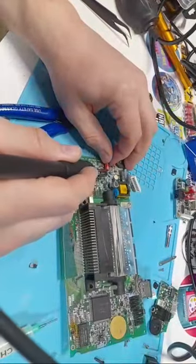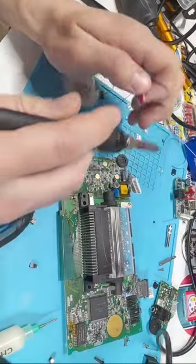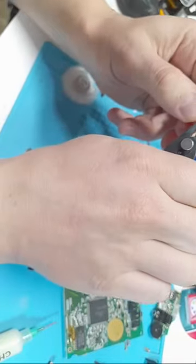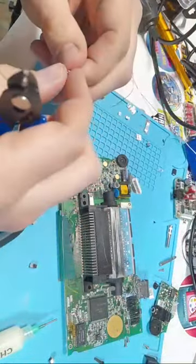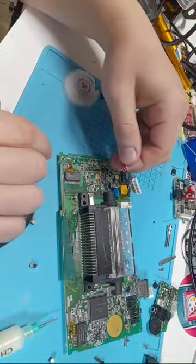That's one way, and then the other way is what I call the toboggan method. Again, coming out with more names. So the toboggan method, which I really use a lot on the audio board because it's very limited for space. So I'm just basically going to push these down. It's better when they're longer, but they're going to go underneath it, kind of like the legs of a toboggan.